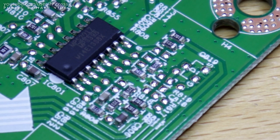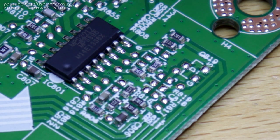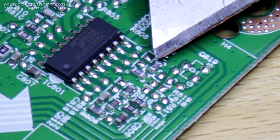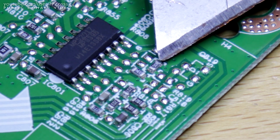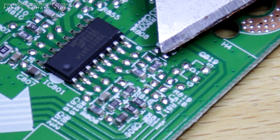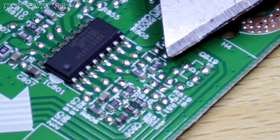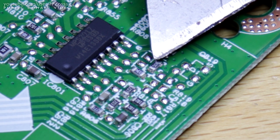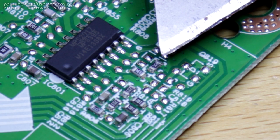So let me crunch the numbers on it. 5,000. That drove at 200 milliamps, and that was already a rather brutal monitor. So we're going to change this resistor for a higher value. On my old monitor, I just put a potentiometer, so I could adjust it as I pleased. But I don't think I want to mess with the case on this one and make a hole for it.